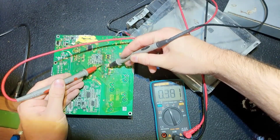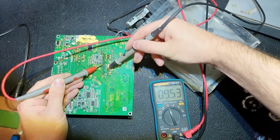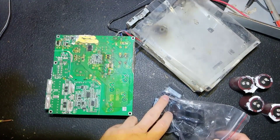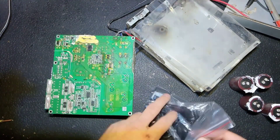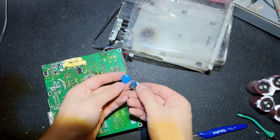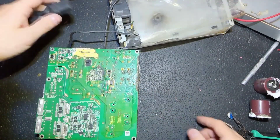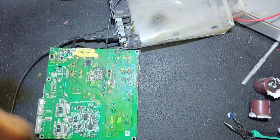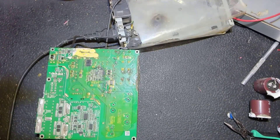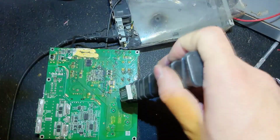No short, no short, no short. This one is maybe a little bit low but we check it on the PCB — about 10 kilo-ohm, should be good. I've bought these caps — not the same but about that value. I put one in just for testing and also got a new varistor.